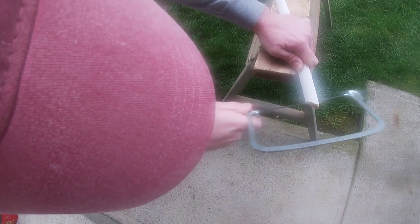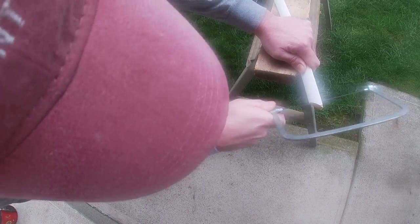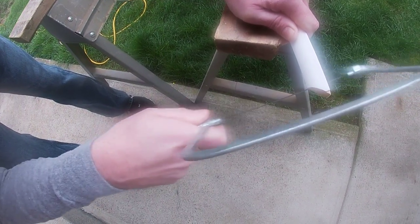All I do is follow that line as I go around. Now that works on baseboard or anything else. If I cut that 45 to the left and I just follow that line, that is going to give me the profile of what I need to cut.